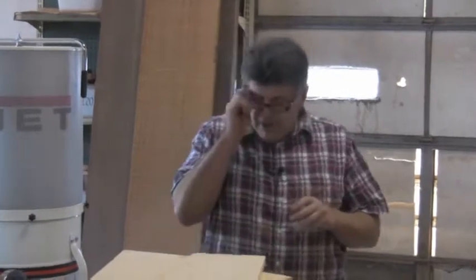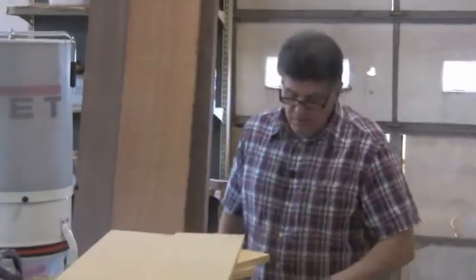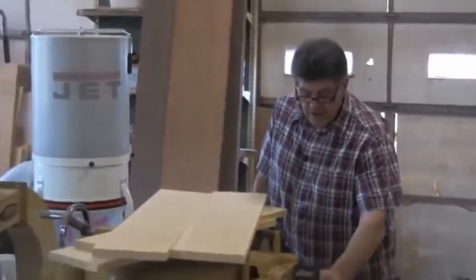That's the reason you notice, when we're doing the high boy and whatever like this, the sides on it are 7/8, but we keep our drawer fronts thinner. And then once we overlay it, it gives it a nice balance. You don't want heavy and clunky, nor do we want it here. So what we're going to do is plane this down to 3/4 and see what we think.